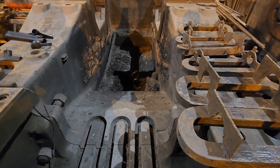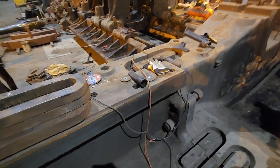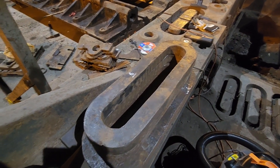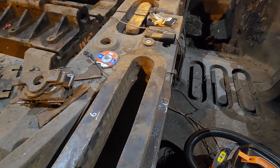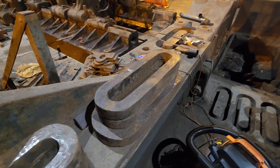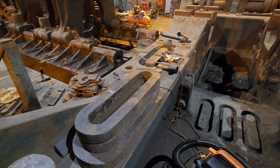Out of the 27 links, we are missing about seven or eight of them — when they tore this apart they couldn't pull them out, so they cut them. We're going to have to make new ones and we'll make them out of plate burnouts and then machine them to size. These were all originally wrought iron, made out of wrought iron square bar folded around and then forge welded together. One of them you can still see the forge weld on it, but we're going to do it the modern way.